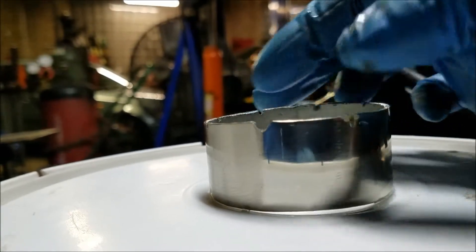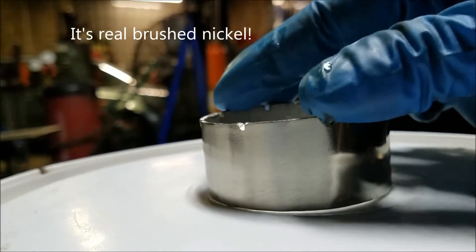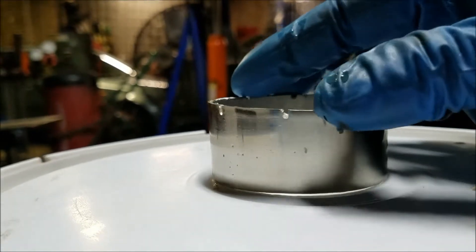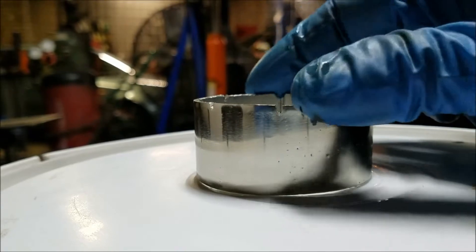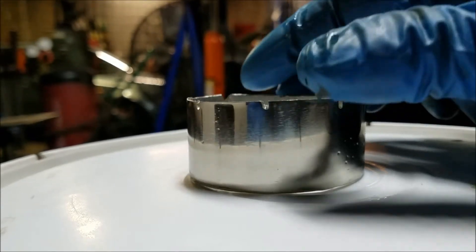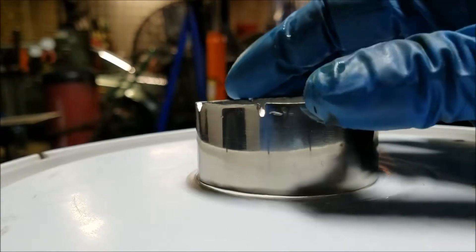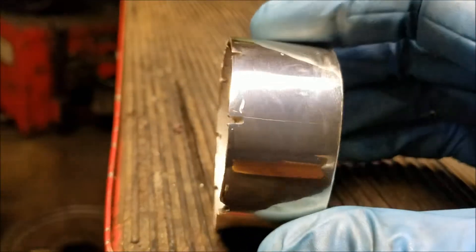The whole reason I did many different levels of sanding on one piece was so that I could see the differences after I plated it, and also to see how perfect I needed to polish it in order to get a real mirror shine. And it turns out, if you want a real mirror shine, it has to look that way before it goes into the plating bath.